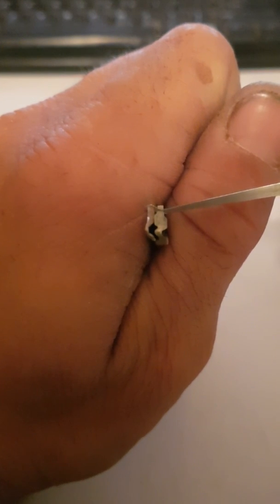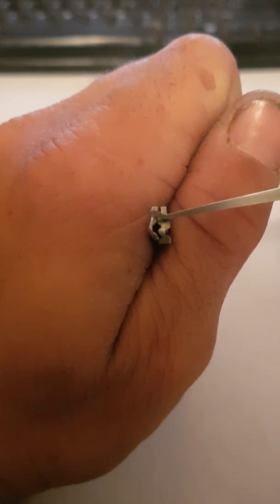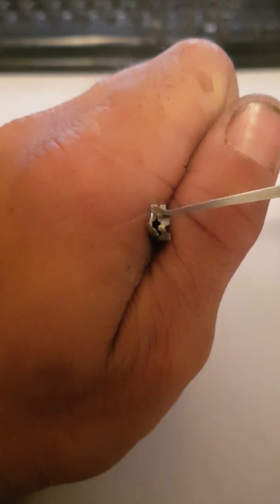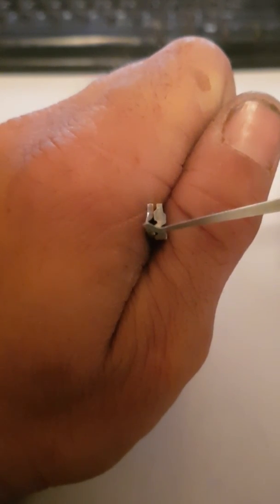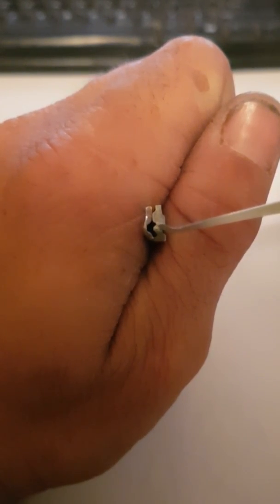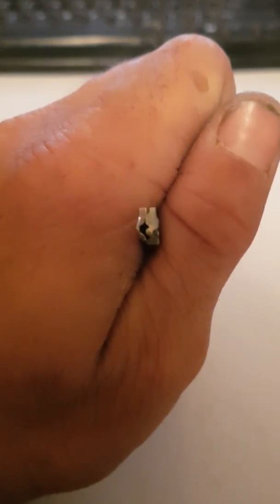Now, it's actually quite a horrible profile to look at. When you sit it beside the Medeco, there isn't a great deal that they actually match up on, but the top portion of the key is nice and thick to allow for cutting to match the pins, and it provides some strength for the key. This bottom portion is actually only to rest or ride in the profile. As you can see, if I was able to actually overlap one over the other, the modified LW5 would fit inside the constraints of the original Medeco key.